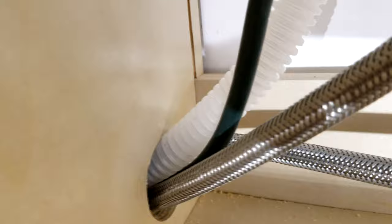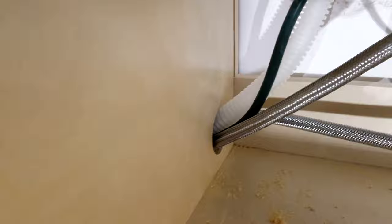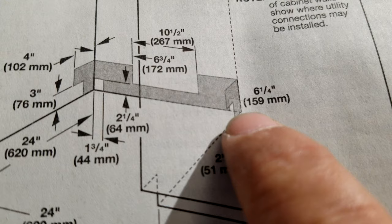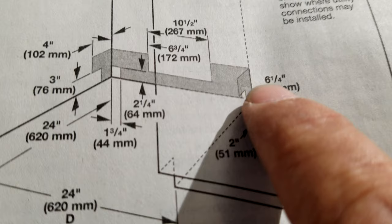What we did at the bottom here was drill a single one-and-a-half-inch hole. Usually the installation instructions tell you that you can put three different holes, but due to the architecture of this particular cabinet it's five inches off the ground, giving you about an inch above the floor of this cabinet to get a hole — otherwise you'll miss the clearance on the underside of the dishwasher. The only area you can drill is this zone, staying away from a two-inch area near the back wall. We have to aim for a maximum of six and a quarter inches high off the floor.